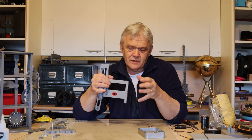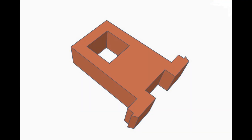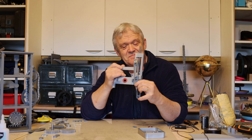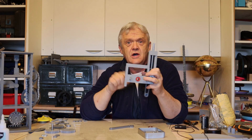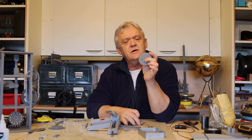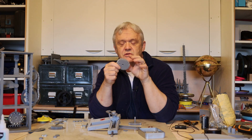So we're going to put in a scotch yoke. The scotch yoke obviously needs a slide mechanism — there's a slide guide right here that the scotch yoke moves in, and we put two of them so it can move and be held in a straight line. The scotch yoke is attached to the bottom pivot point, so as it moves it will move that pivot. The scotch yoke is made from these parts: there's a gear with a hole in it so we can drive the scotch yoke directly from the input gear.